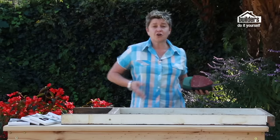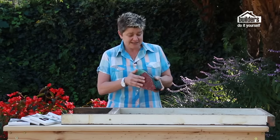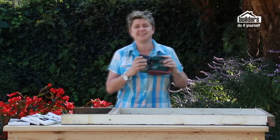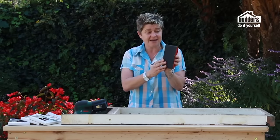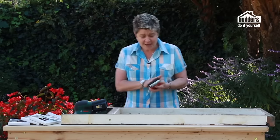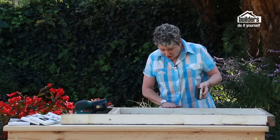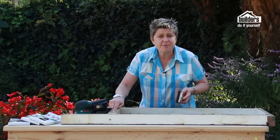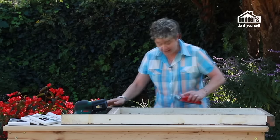If it was a new one it wouldn't need as much work, but the first thing we want to do is get an electrical sander. This is a great little tool — it's got a lithium battery attached and works for hours. If you didn't have one, you can always use a sanding block, though it takes a little longer. Start off with quite a rough grit to get off all the hard, tardy bits. We've got a bit of paint and glue left on here that we need to remove to prepare it for our undercoat.